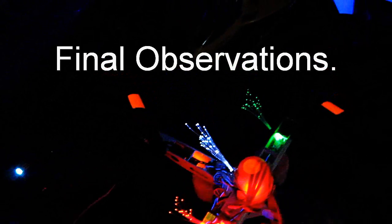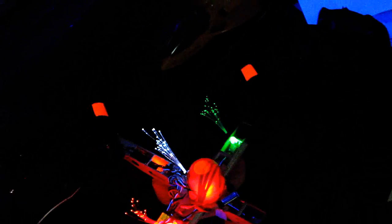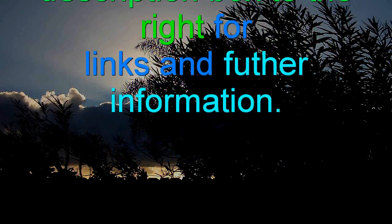Okay, there we go. I noticed a couple of things. First of all, you're definitely going to need a BEC because the speed controllers I bought don't seem to have enough power and occasionally I lose signal. Second, as the power runs down with these big props, it gradually starts to want to roll — so you get an indication when it's not staying level anymore. Other than that, about 90 bucks I've put into building it. Without directions it was challenging, and that I like. This would make a good school project for science class, I think.